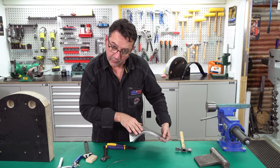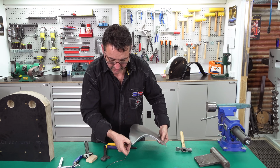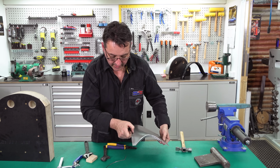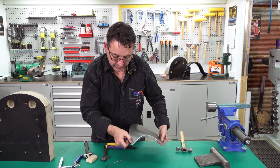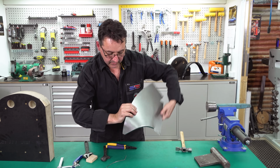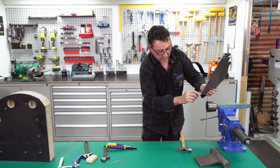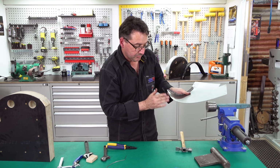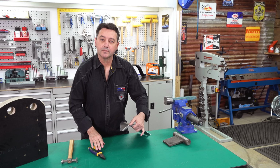I've predominantly formed most of this front edge as far as shaped and shrunk. The next one I'll be doing is our outer top edge where the guard will get attached. This I'll be turning outwards with our pliers and then stretching or hammering over our former to stretch that flange by simply stretching through the flange of the metal.